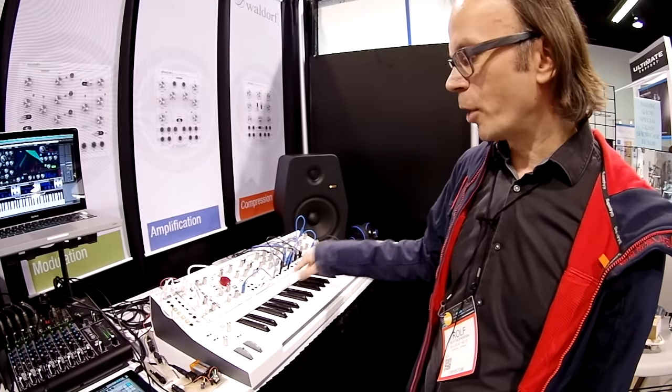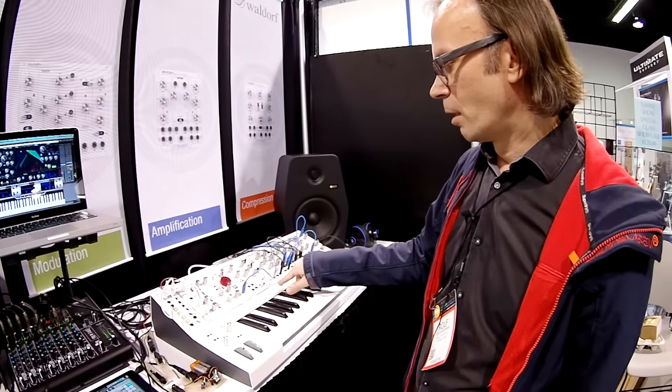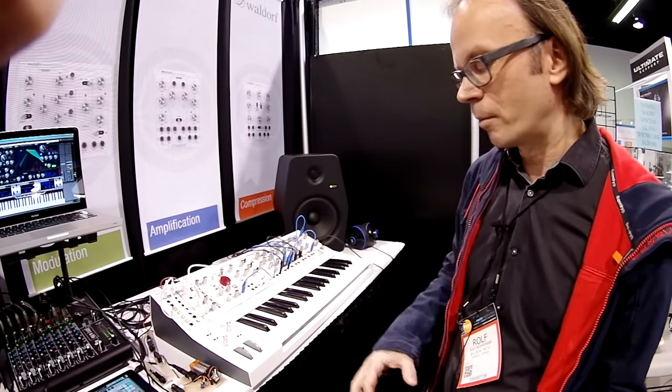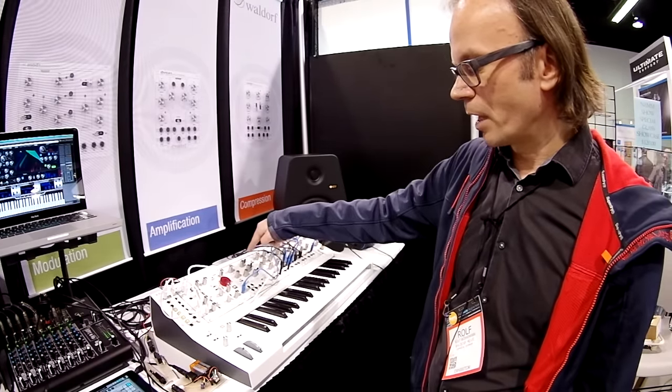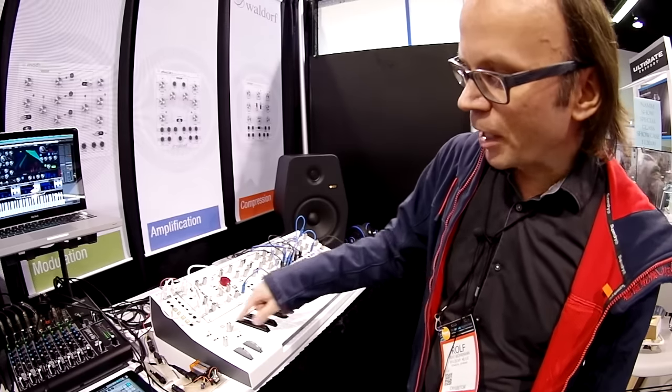There are not too many compressors on the market, so we are using high-end analog technology here. All the modules, except for the wavetable oscillator, are new, pure analog design. So there's no digital stuff behind, so we wanted to give some new ideas for the analog stuff. For example, with these three decay stages, you can loop them, and there's a lot of modulation possibility you can do here. And this is especially nice for the wavetable oscillator, because it has many parameters which invite to be modulated in some ways.